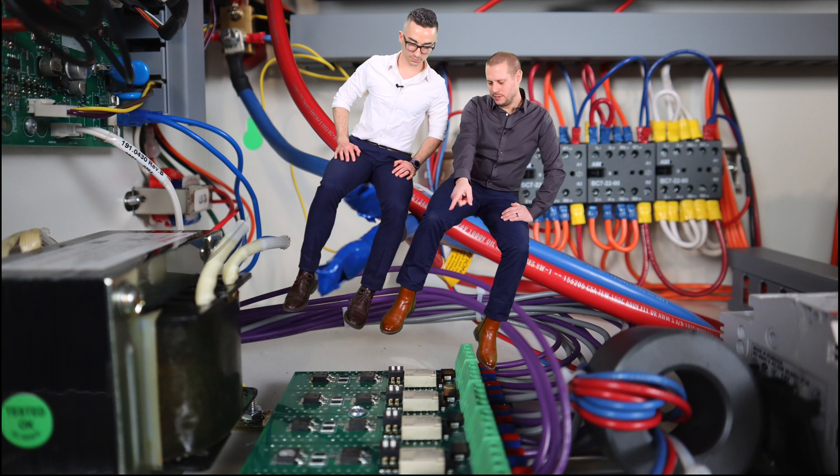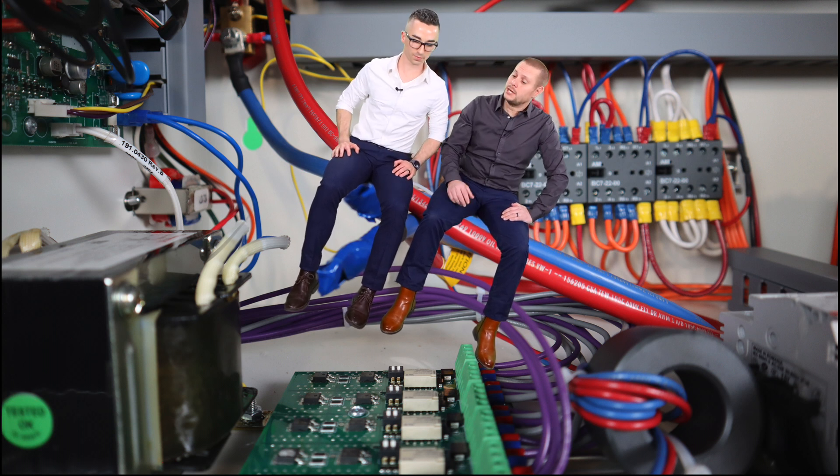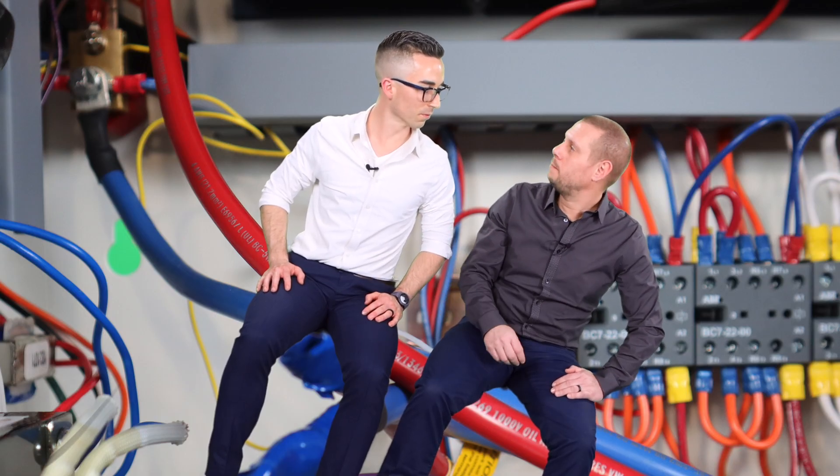All right, with our first feature, is that card right down there? The one with the purple and gray? Yeah, that one. It actually serves two purposes. One, to shunt your zero to 10 volt loads to full brightness in emergency. And two, to allow you to put more fixtures on a circuit by reducing the output in emergency.